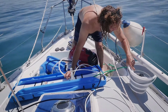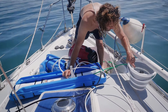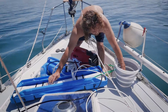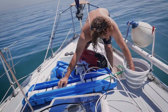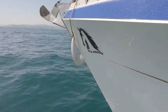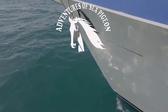After filling the water tanks on our boat, we decided to flush the system through with fresh water — water that was made with the Rain Man. Under no circumstances should you use water from taps as this can contain chlorine and can be quite destructive to the membranes. Again, it is important not to run the bucket dry as you do not want to suck air into the Rain Man. Fantastic. Thanks for showing us that, Neil. Now we're going to be completely independent — no more being held for ransom for water.